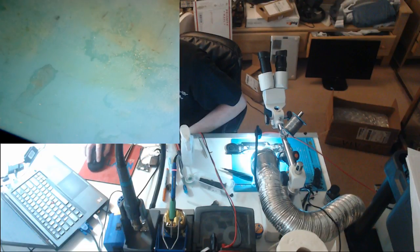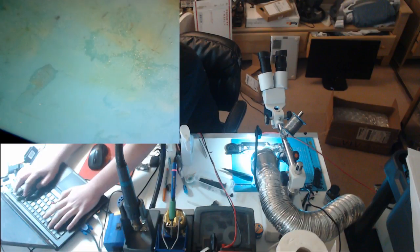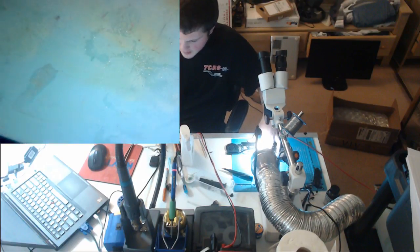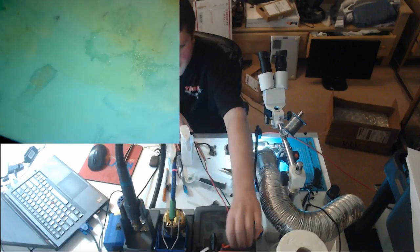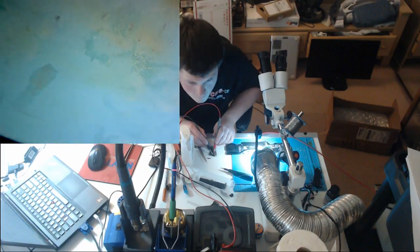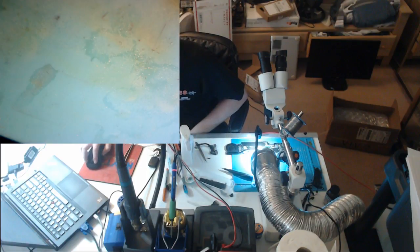And let's see, I didn't even think of that because the fuse never blows. Oh, F6905 is on the DCM board. Okay. Either way, let's check it. Fuse is good. Okay, so if the fuse is good, we should be getting, well, no, we need R6905, so let's check R6905.